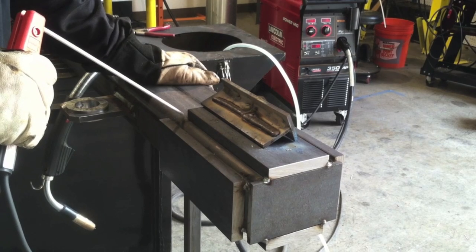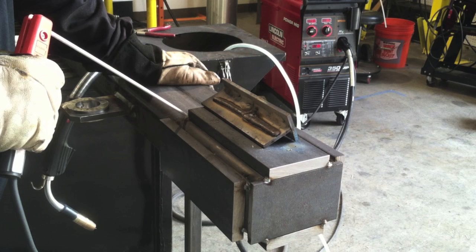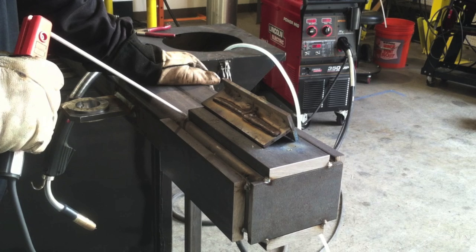You can see the little T joint I've got laying there. I ran a bead on a little piece of scrap to make sure the amperage was going to work okay, and it seemed to be pretty close, so we're going to fire up. This is a 1/8 inch 7018 rod, and I like to set them up kind of hot and keep a really close arc. For 7018 it's recommended to have a low dig setting to run a smoother arc, but sometimes I like to ramp up the dig function a little higher so I can almost drag the rod right in the joint.